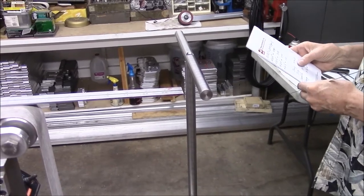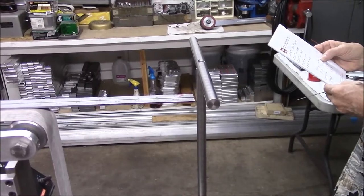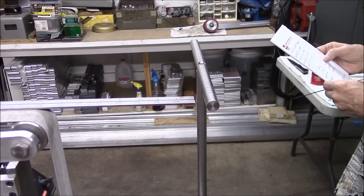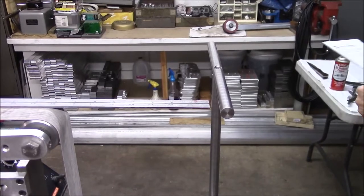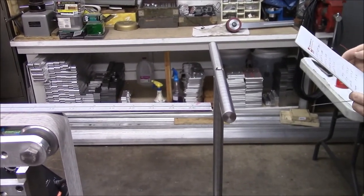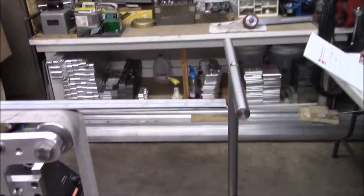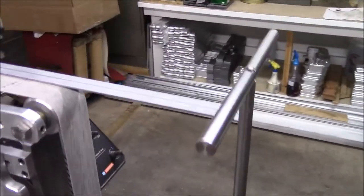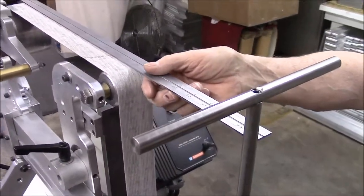Shaving angles are normally 5 to 15 degrees on a razor or anything where you don't care about durability of the edge and you're principally concerned with sharpness. Slicing is generally 15 to 20 degrees — I tend to be on the lower end. General use is 20 to 30 degrees, and chopping is 30 to 40 degrees. Everybody picks their own angle. That doesn't make it right, that just makes it what I do.